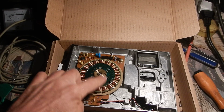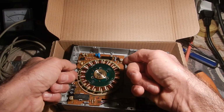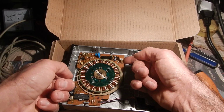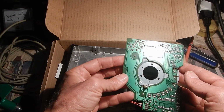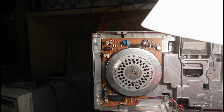After lifting the rotor, we need to remove 3 more screws. Then we can carefully lift all the spindle assembly, rocking it from 2 opposite sides, like this. Now I can inspect the traces and measure all the capacitors' ESR. In this case, every capacitor showed good low ESR, no traces showed any corrosion sign, and there were no signs of leakage. So I just reassembled everything and I'm now ready to test this floppy drive.